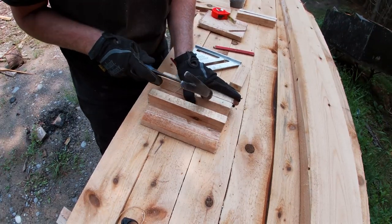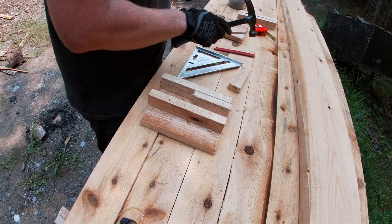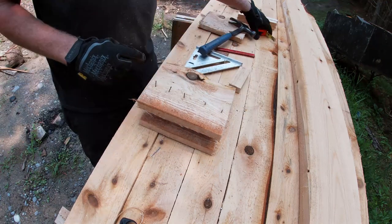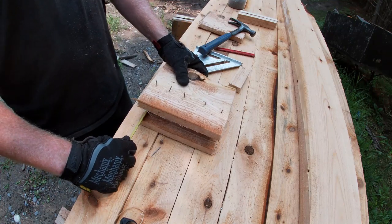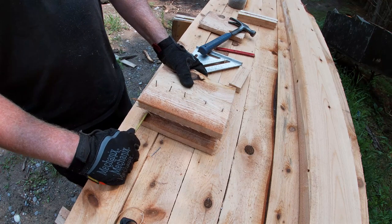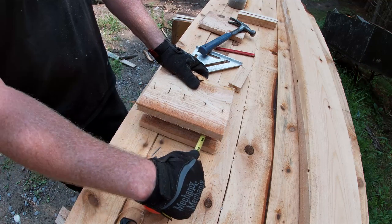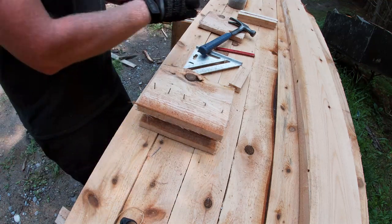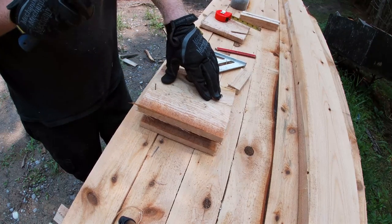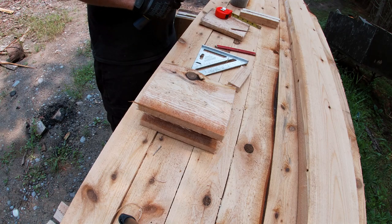Before I stick the top on, I'm going to put one of the small blocks in here flush with where the top's going to be — they're kind of interchangeable, but I'll stick that on there and get a couple of nails in it. This will just act as a little stopper. I already know the bottom parts are in the right place, so I'm just going to measure and line the top up accordingly so it's the same as the piece on the underneath, then nail the other side in and that'll be the first jig complete.